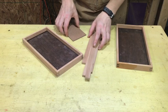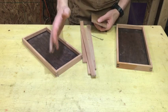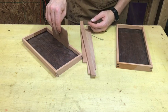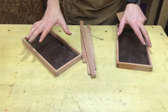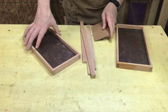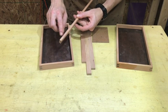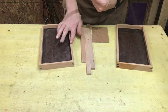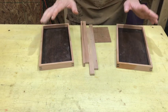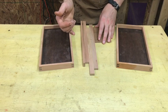But, however, focus. We are now going to cut the internal dividers, and this would be a more personal thing for you as to what you want your segment sizes to be. However, get a piece of scrap so that we can dial in the height of how high our internal dividers are going to be, especially if you have different size trays, which I do. One's about 1/8 of an inch different than the other. In my opinion, aesthetically, we've got a light roundover in here. I like the top of my dividers to meet the roundover rather than the top of the outside edge. Just aesthetic, no functional difference. I just think it looks better that way. So decide early on where the height that you want to match is. If you put the roundover, do you want it on the roundover? If you didn't, then the top is fine.